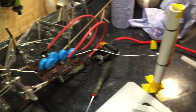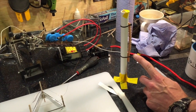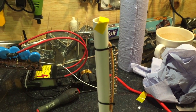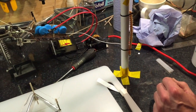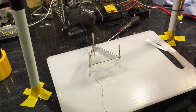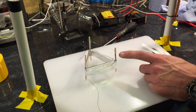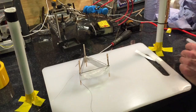And then we come out here into the 2 leads, up through a load of small resistors. That is basically giving us a very high voltage resistor. Any one of these would just arc across. That's in order to get a smoother current. What we found in the experiments is that the smoothness of current into the ion lifter itself is pretty much everything. If it's a spiky voltage, then you're just going to get arcing and discharge, and in fact, as you can see on this one, you'll end up burning the legs. And that's pretty much it for the setup.